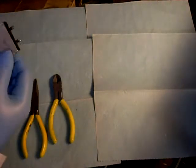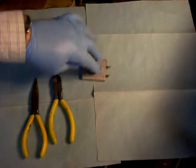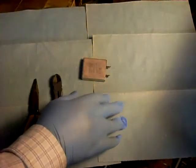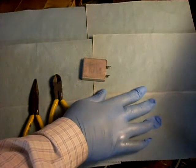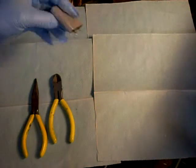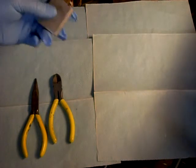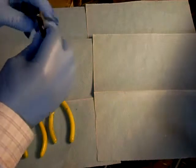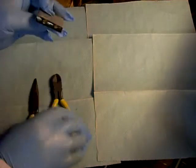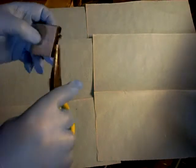Here's the capacitor. It's a Russian telephone capacitor dating to 1969. The reason I'm wearing rubber gloves, or vinyl gloves, and the table is covered with tissue, is because these can contain PCBs. In the West, they would have been outlawed before 1969, but in Soviet Russia, who knows? This capacitor has failed short circuit. As you can see, it's sealed here with pitch or tar.